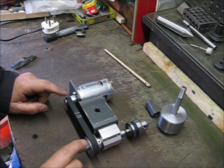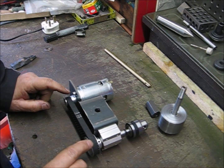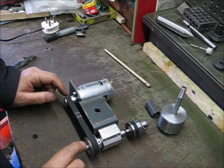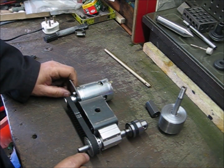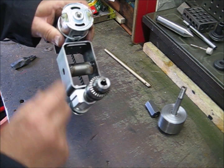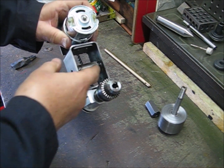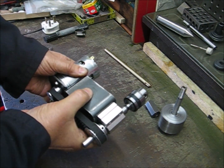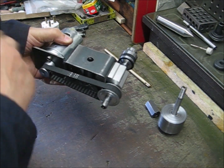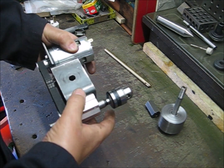The pulleys are 2 to 1. This particular motor is rated at 9,000 RPM on 24 volts and I think it's 6,000 on 12 volts, so divide by 2 and you've got the spindle speed. To mount it onto the lathe I've fastened it onto a piece of box section — 70 by 50 box section — with a spacer spot-welded in between so when you're clamping it doesn't distort in the middle. This angle bracket here is just another piece of box section I've cut out.